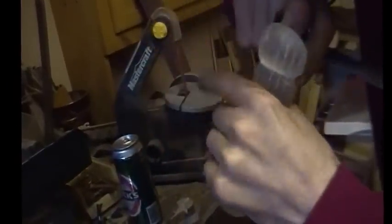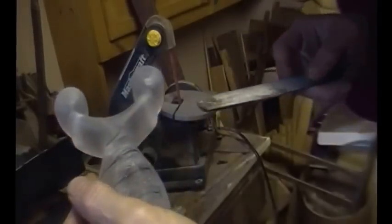I've done a little bit more shaping with the rat tail file. You can see the palm swell groove is nice and form fitting now. Now I can get a nice firm grip on it and determine where my finger grooves are going to be. I just traced the outline of each of my fingers on here, and that tells me where I have to start digging into it with the rat tail file. I try to get these little indentations aligned with the joints of my fingers, then I'll use the half round file to smooth them out and make it so I can actually fit my finger inside.